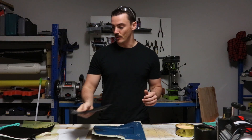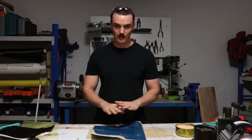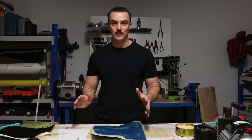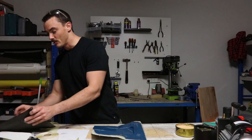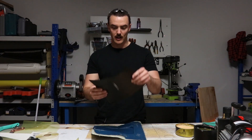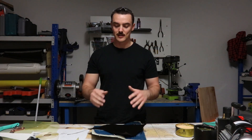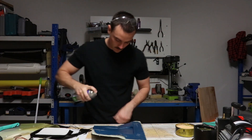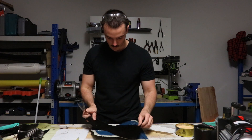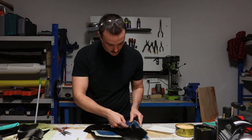After that complete failure, we're going to do the whole thing again. The mold's been cleaned up — I went over it with 600 and then 1200 grit sandpaper to make sure there's no resin left over. It's been waxed, with all the old gum tape pulled off, and now it's ready to lay up the carbon fiber again. I'm doing two things differently this time: instead of laying the carbon fiber in line with the weave, I'm doing it on a 45-degree angle. This helps the carbon fiber flex into the corners of the mold more easily and hopefully avoid those voids. I'm also using a bit of extra spray glue, especially in the corners, and really pushing the carbon fiber into the corners this time — it seems to have stuck in there pretty well.